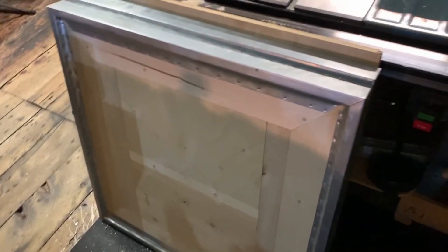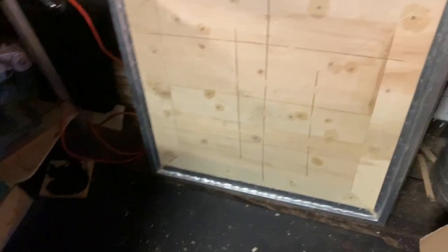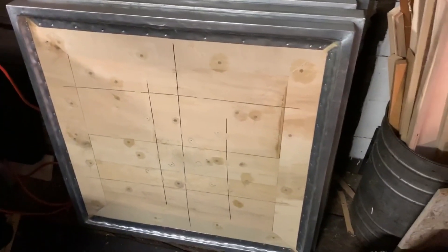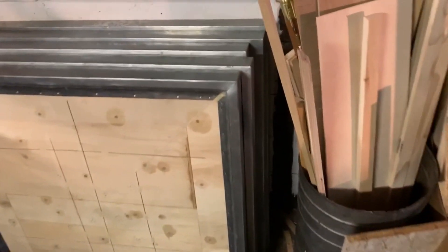I have a method for repairing these which I'm going to demonstrate. I have a glue injection method — boring holes underneath, injecting glue, and filling up the empty space. This repaired one doesn't have any puff in it. There are some ridges but they're pretty much filled with glue. On another one I made some saw cuts and added wedges where it was more severe, to add tension to the substrate.